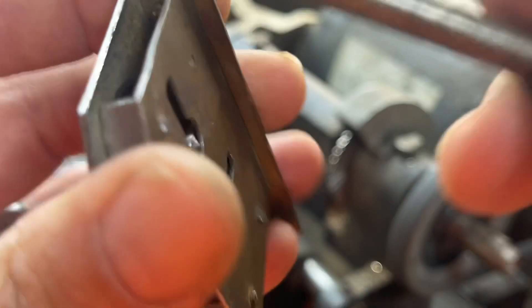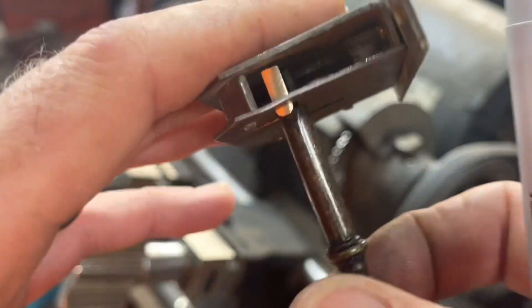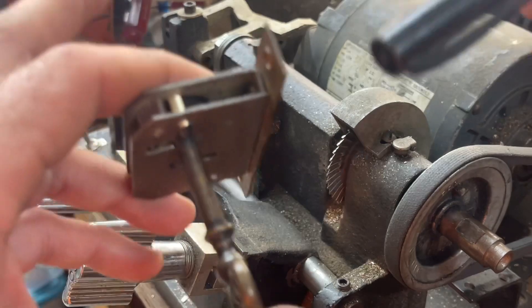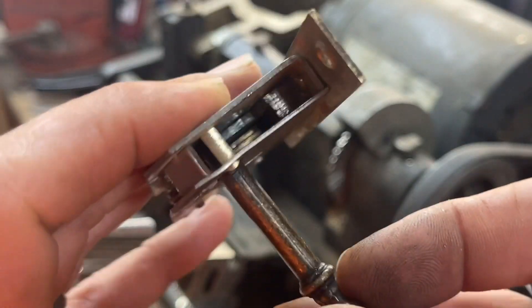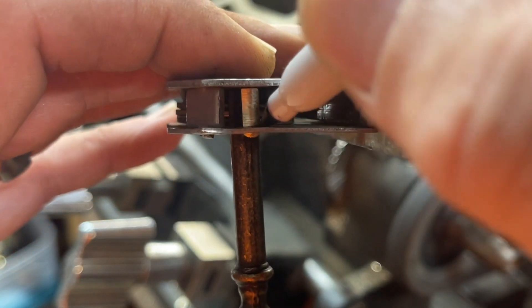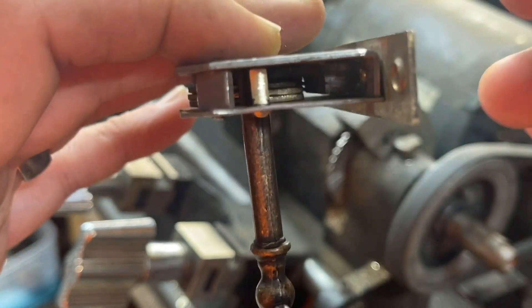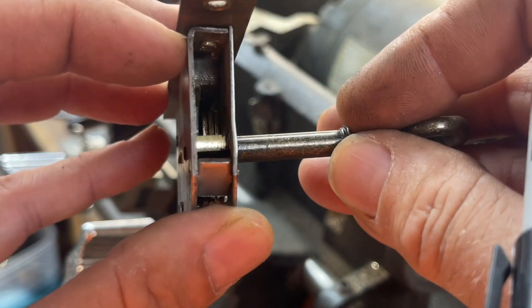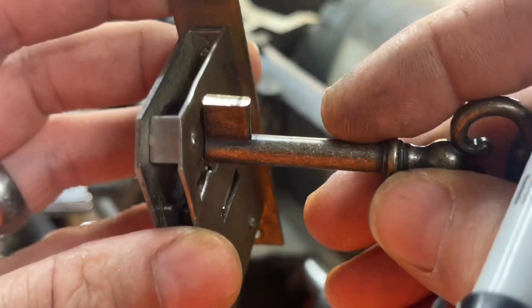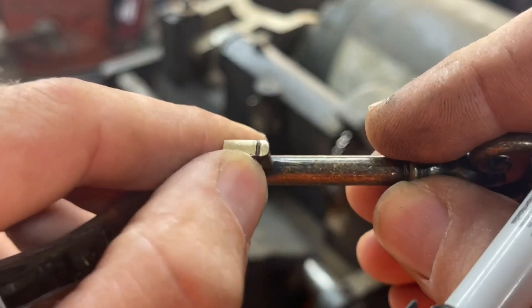Let's move over here and make our marks so we can turn it and see what's going on. We have to get rid of this part of the key. I'm going to use this key machine — I just put a brand new wheel on here, and it cuts beautifully. But you can do this with files; I've done it in other videos. I'm going to mark the back side with a fine point Sharpie so we know not to cut beyond that mark, because the first lever is right up against that blade.